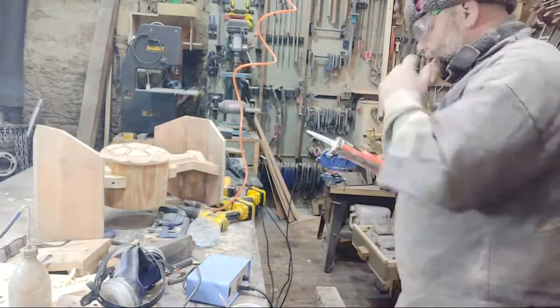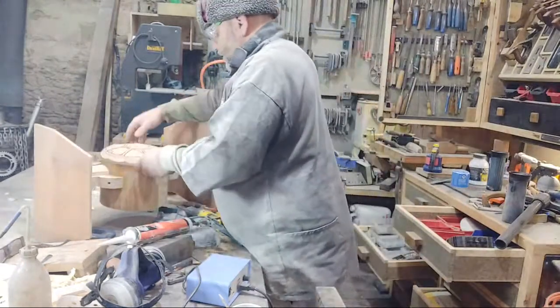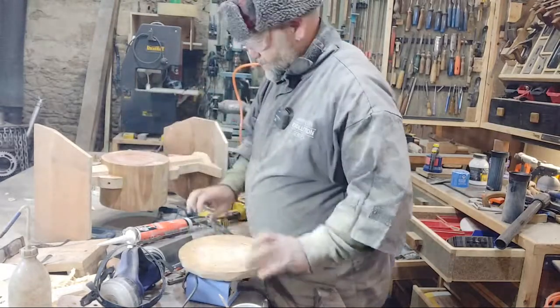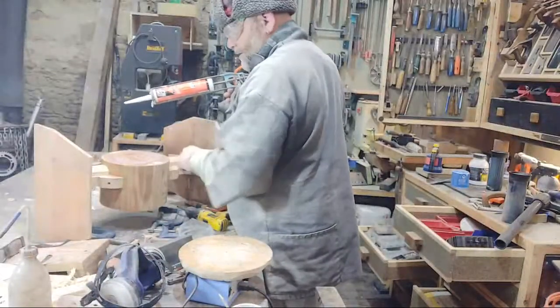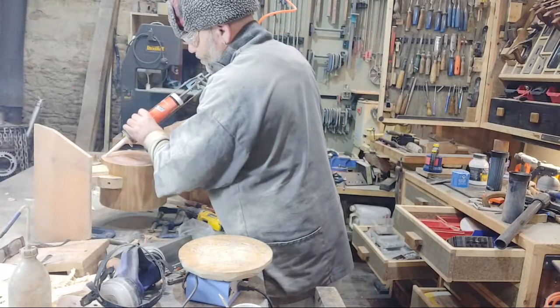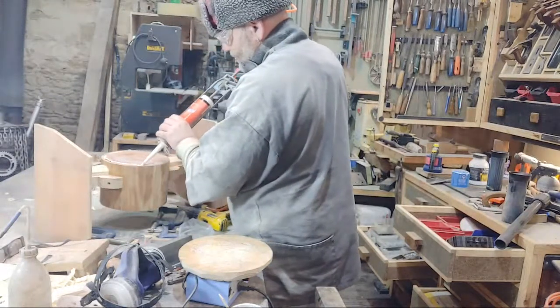It's not silicone. You can't use silicone because if you put the first coat of paint on, if they're water-based paints, it'll resist it. Silly me. All the way around this outside edge, with all these cuts in this wood, if I don't seal that, within reason, it's not a perfect situation, is it? But it's got to help.